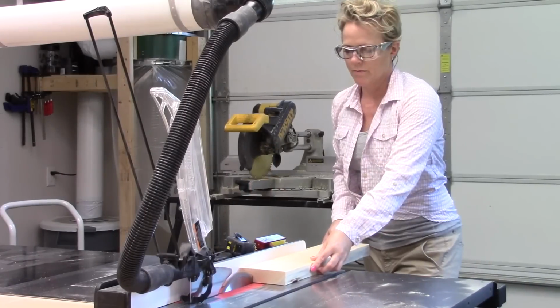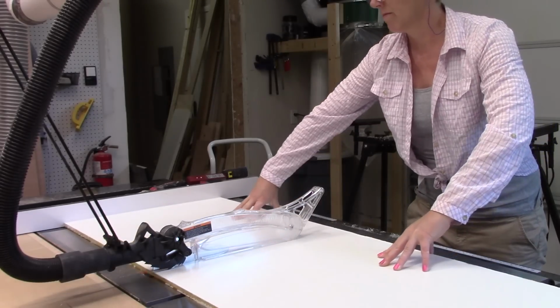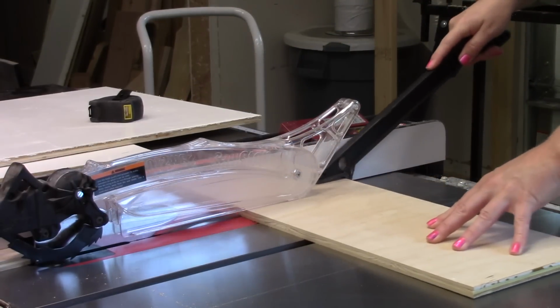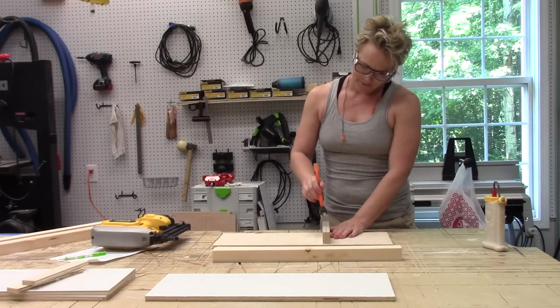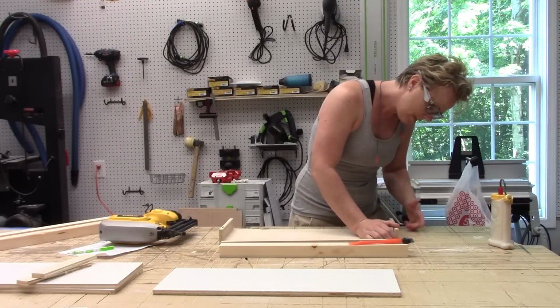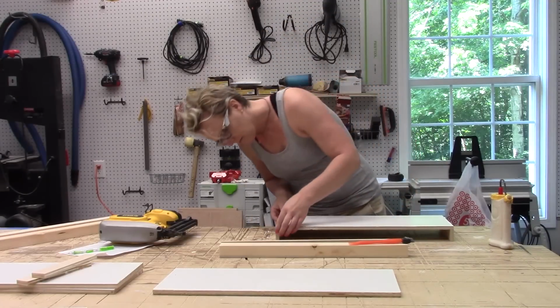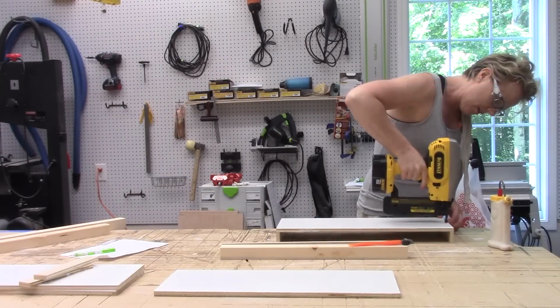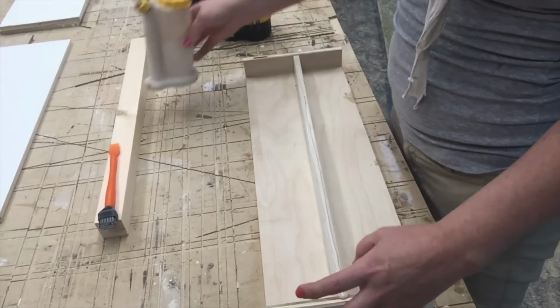I started out by cutting a 1x6 into 3 1.5-inch cleats. Then I used 1/2-inch plywood to cut my shelf tops, bottoms, sides, and front. The back is open so the shelf can mount on the cleats. I started out by attaching the sides to the shelf top. I used glue and 1 1/4-inch nails. I used my DeWalt 18 gauge finish nailer for this. The battery power makes it very handy and convenient. Then I glued and nailed the front strip on.